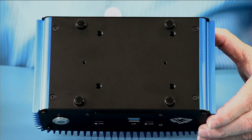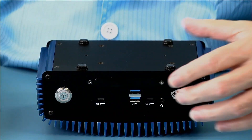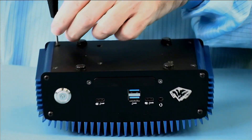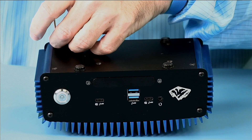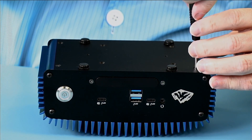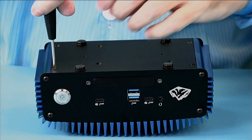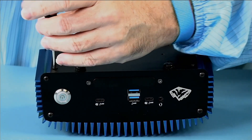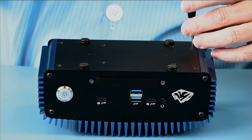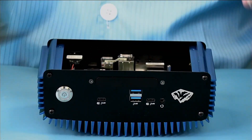As you can tell, I have my anti-static smock on, my wrist strap, and I have an anti-static surface because now we're going to open up the unit. It's important to always follow all anti-static precautions anytime you expose static sensitive electronics to prevent damaging it. There are four screws to hold the bottom plate on, and then it just lifts off.